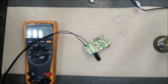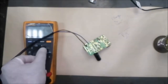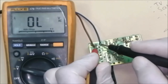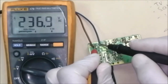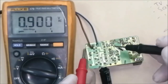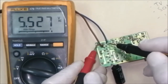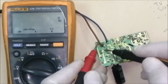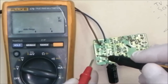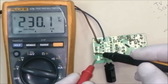Let's start. Set the multimeter to AC voltage. Carefully, never touch the live line. It is 236 volts. Now we will check the output of the fuse — connecting one probe at common and the second probe after the fuse. It is about 236 volts.